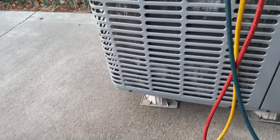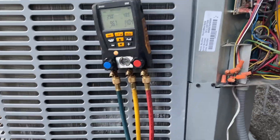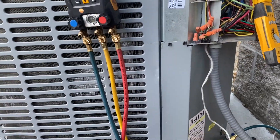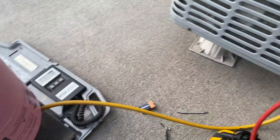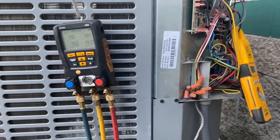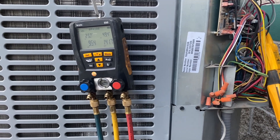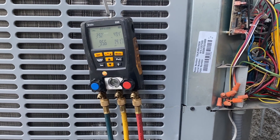It's all back together and running. I'm still charging — the refrigerant. It can only take four pounds with the unit off and it needs 14 pounds total, so I have it on cooling mode now, just sucking in the rest. We're almost at eight pounds. I'll finish this up — everything seems to be working so far. We'll see once it's fully charged and we run it in heat.